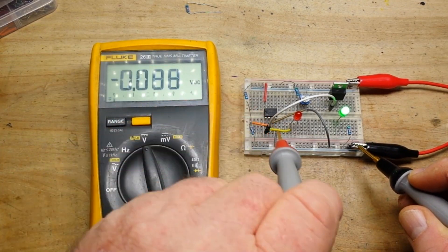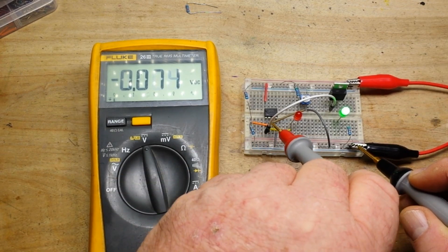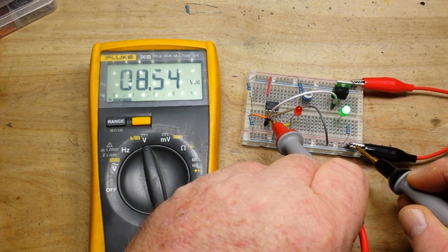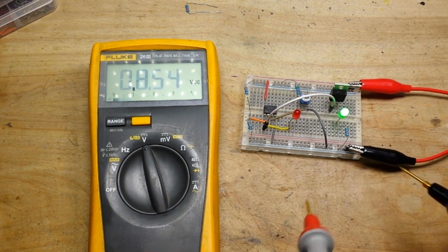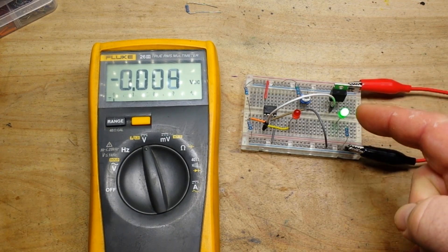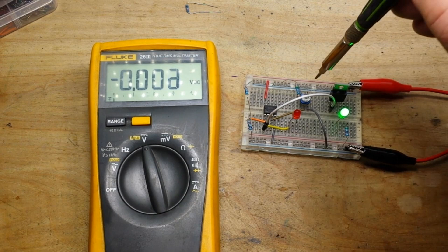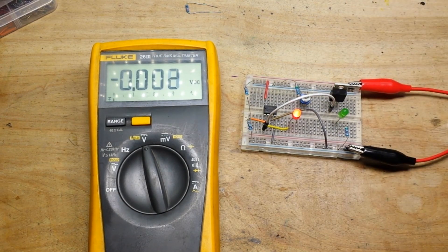Getting on that pin without blocking it — you're seeing 8 volts there on that pin. That's enough to open the gate of the MOSFET and allow the drain-to-source channel to open. So if our voltage falls below that point...